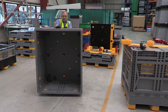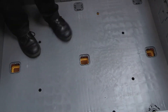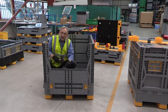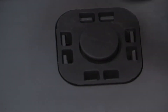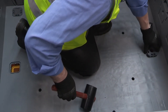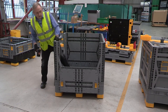Put the bin back on its feet, and then we're going to refit the base locks and the base pins from inside. Take the base lock, position it squarely into its hole, one hit with the mallet. The same with the pin — into the center of the base lock — and that's now secure in place. Repeat that process for each location. And that's the new fork strap fitted and in place.